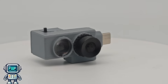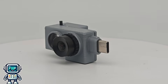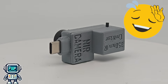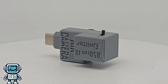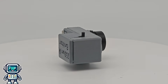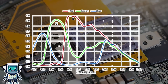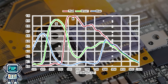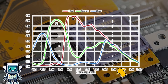On the face of it, it might seem like building a custom night vision camera would require a very special optical sensor. Fortunately, that is not the case. At its heart, this little contraption uses little more than a basic entry-level USB camera module. Basic CMOS camera modules can see a lot more than just the visible parts of the spectrum that your human eyes can perceive. These image sensors can see quite deep into the near-infrared part of the spectrum.